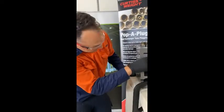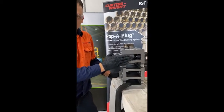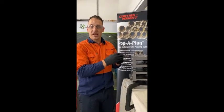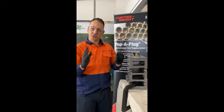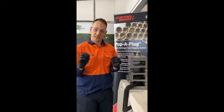What you've now got is the breakaway section on the plug side sheared off at the correct pressure. If we were to get to 7,000 PSI on the pump, we know that that plug has gone beyond its working range and it's an undersized plug. Normally if it's got a bigger range, you may have two strokes on the ram — tighten it back up and have a second crack at it. 7,000 PSI is the main key indicator.